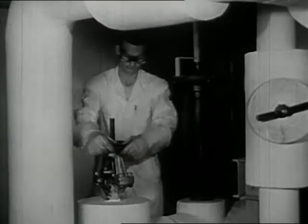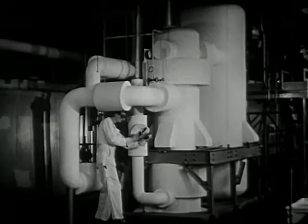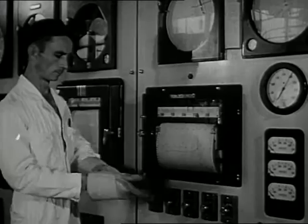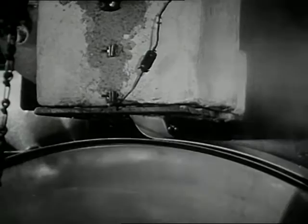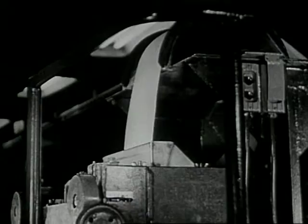At the nylon plant, this liquid is made in large tanks, then piped into an evaporating tank where some of the water is boiled away. Next, it is piped into a room full of large vessels that are something like pressure cookers, controlled by instruments on a panel. This man is starting to cook a batch. It cooks under heat and pressure, causing an important chemical change. The nylon comes out of the bottom of the cooker as a wide, white strip — solid nylon. It hardens under sprays of water, then goes into a machine that chips it into flakes. It's blended and melted and then pumped to the spinnerets.